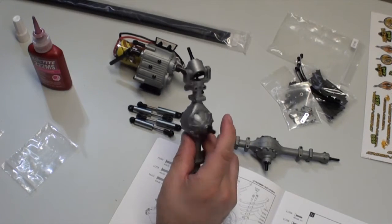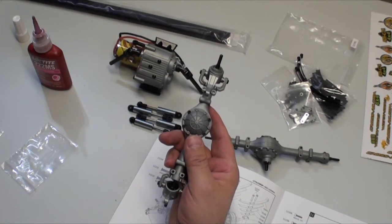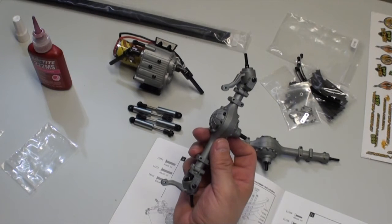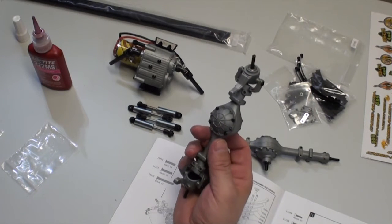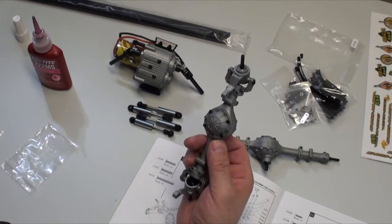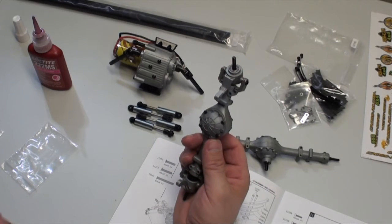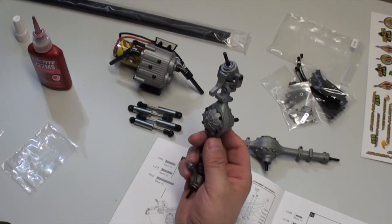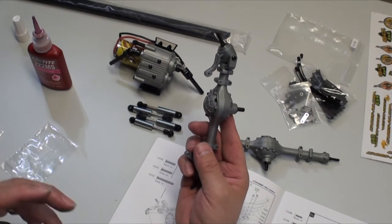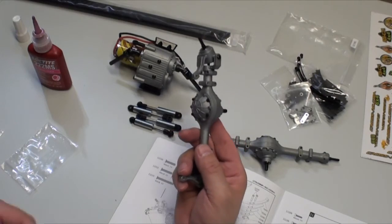One of the things that you do not want to do is be putting in something with a 1.5 millimeter head on it, accidentally strip it out, call it good, and leave it in there. You've got that thing Loctited in, and months down the road you decide you have to take everything apart so that you can re-lube, re-grease things, you try and get it out. You already stripped it out before, you can't get to it now, and it just becomes a pain to pull this stuff apart. So, Loctite it, seat it real well, but don't crank down so much that you end up breaking or stripping something out.